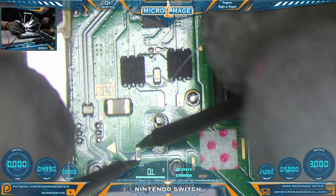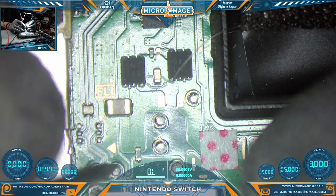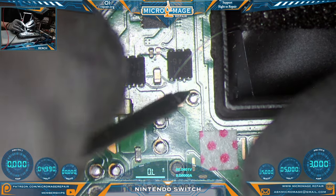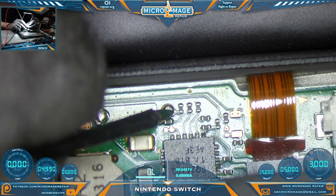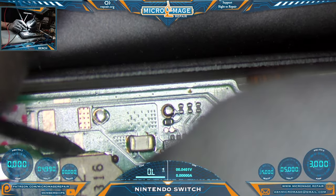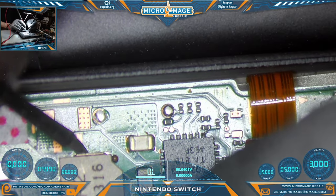Making sure the invincible fuse is still being invincible — we wouldn't be getting 15 volts if it wasn't. Checking our test pads: none of these test pads should be shorted to ground, and these test pads should be shorted to ground. This coil should not have a short to ground, but it should have continuity going through it. You can get through the gunk to get contact — there we go.